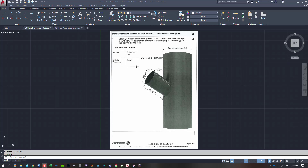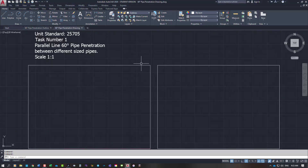You would work to the mean diameter, taking your material thickness of five millimeters away from the 100 millimeters, so you'd work to a mean diameter of 95 millimeters when drawing the interpenetration of the pipe at 60 degrees. I'm going to change some dimensions for this drawing — changing the leg length to 55, the top to 120 — but keeping the main body at 200 millimeters.